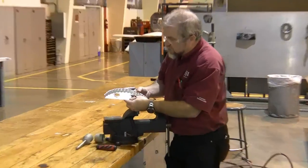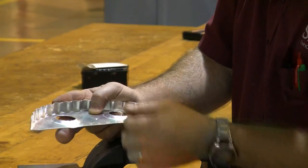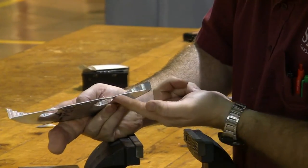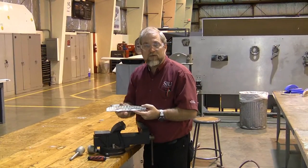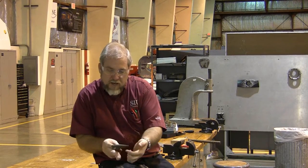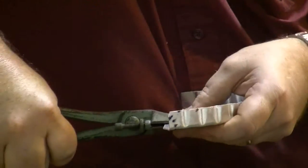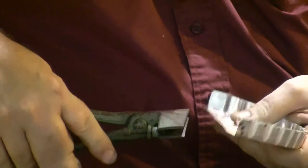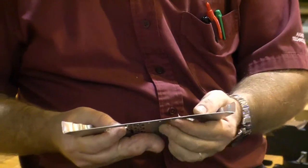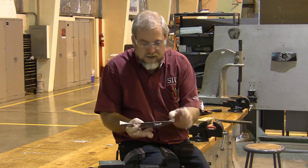There's my flange — this is most of the rib formed. I want you to notice that just like on the last one where we folded flanges in, we saw some puckering. Here we have a little pucker as well, and we want to straighten that out. Let me show you a tool that does that really, really well — these are called seaming pliers. They have a big, wide, flat jaw to grab a hold of sheet metal and bend it into whatever position we want. I'm going to grab this and very carefully re-straighten that piece of sheet metal. It does a beautiful job of straightening everything out. This is annealed material so it bends so wonderfully easy — I can even do some of this straightening with just my thumb and finger.